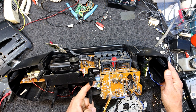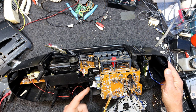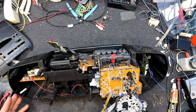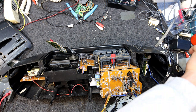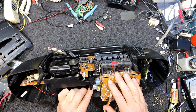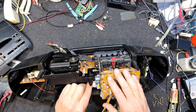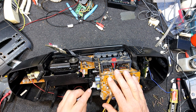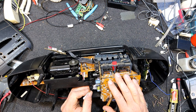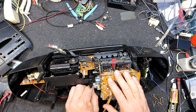But they put so much white paste everywhere, I can't even start to read what that is. Being a Sanyo, it could be a Sanyo chip. Or it looks a lot to me like a Toshiba TA chip. It's been a long time since I've even seen one in that sort of flat package. Yeah, I'm pretty sure I've seen a T come out, or am I imagining things? Now I can see the 'Tos' of Toshiba, I think. And TA something, probably an 8 something in this era.